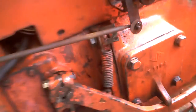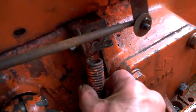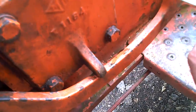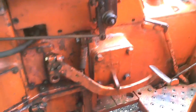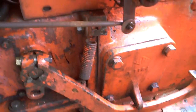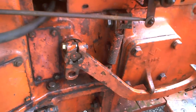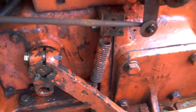What I have done is this job here - this is the next job and this is successful. So let's have the successes. This bracket here was all bent up and twisted with this clutch spring on, which was quite tight. And it needs that - it's a proper thing. It needs it to hold it off the thrust bearing, but it was right up, so it's touching the thrust bearing. I've got probably tomorrow - it's Friday today - so probably tomorrow I'll find someone at a show. There's a big show I'm going to, and I can find out some details and take some pictures of how things are supposed to be. So at the moment, it's Malcolm 1, Tractor 9. We'll get there.